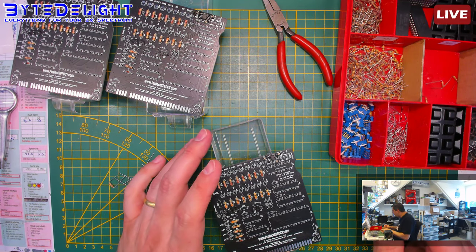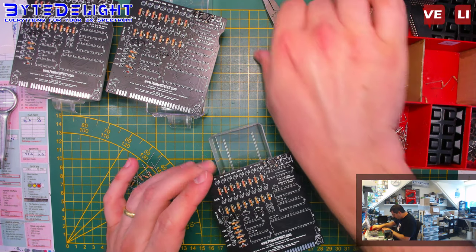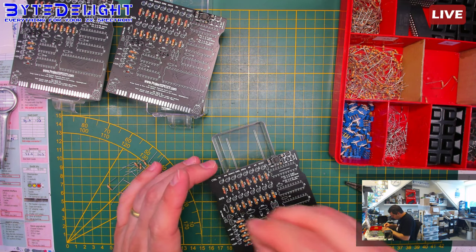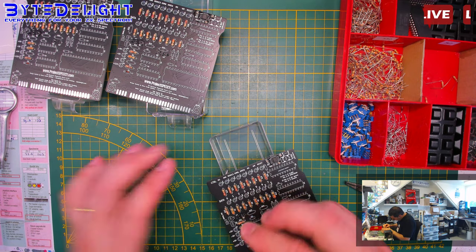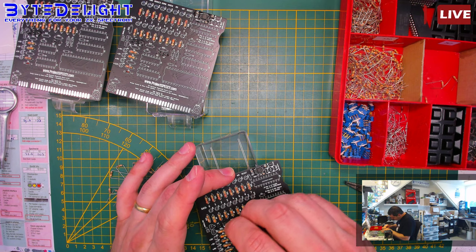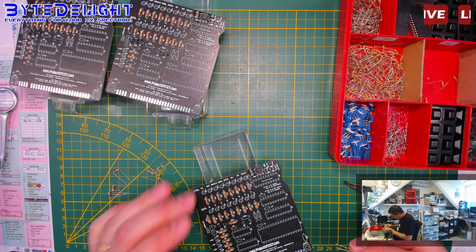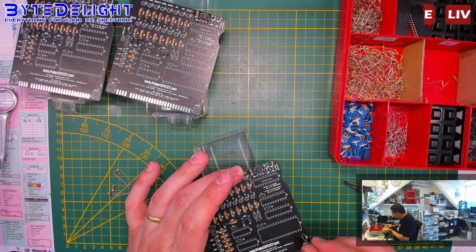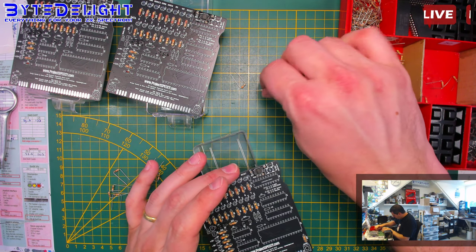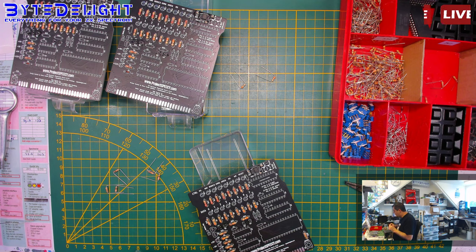Okay, I'm thinking of something, but anyway, let's get it going. R21, because I'm using the default resistor values at this moment, I cannot use the super bright LEDs, but anyway, we'll use the colored ones then. Not the biggest issue. R22. Get a new one. R23, 25, 24 needs to be a 330. And 26, the last one here, is a 10K.